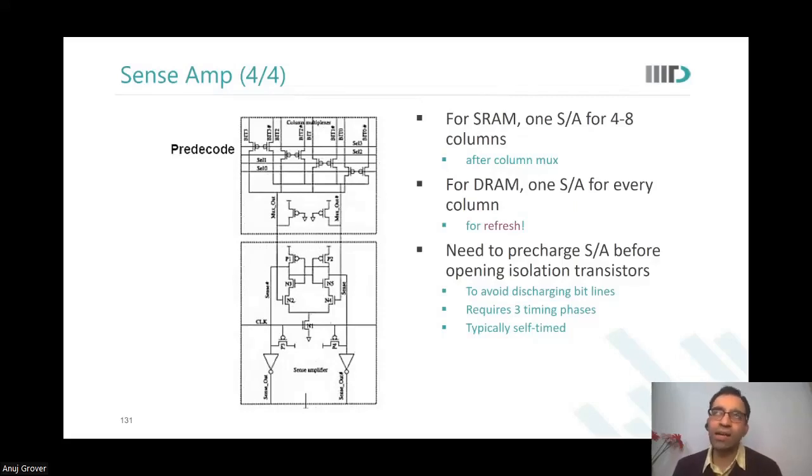Yes. So let us look at it like this. Let us say for an SRAM, the area of the array is 9, the area of the periphery is 1, total area is 10. For a DRAM, that 9 would shrink to, let us say, 2. Say you made the periphery three times bigger, from 1 to 3. What happened? Total area is now 5. Comparatively, half the area. Yes. I'm just giving you some rough cartoon numbers. That is not the reality. Even in a DRAM, the array takes much, much more area than the periphery. But I'm exaggerating the situation for you.